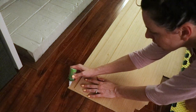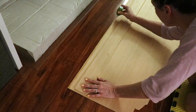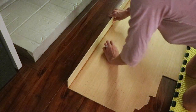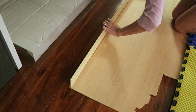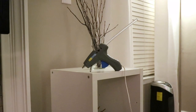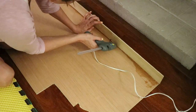I laid it out on the ground and used a quick-setting wood glue — it cures in six minutes, which I was impressed by. One side worked pretty well, but I quickly found I couldn't use this method because my wood was bowed and didn't line up flat — there were pretty large gaps so the glue couldn't even make contact. So I got an industrial glue gun and just glued it in place, which actually helped fill in those large gaps kind of like caulking.